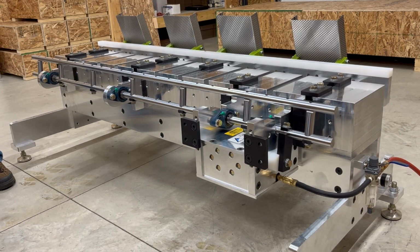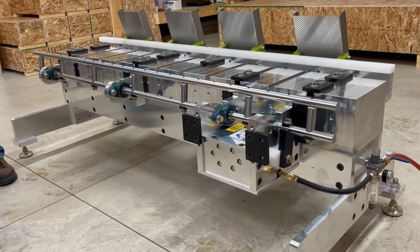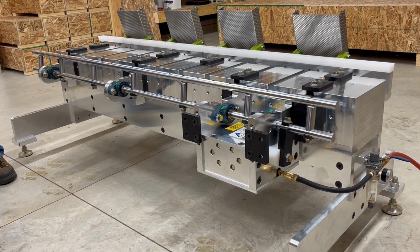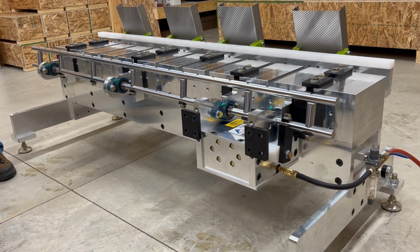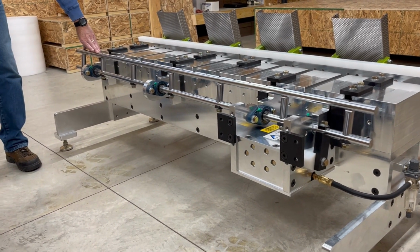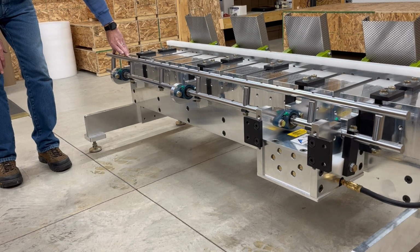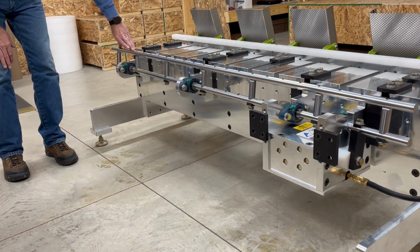We're going to wrap up this presentation with a live demonstration showing you a couple different things. First, we want to demonstrate the Radial Pro-LD's ability to resist off-center loading. To do so, we're going to turn the shaker on, set at 40 psi, which means it generates 175 pounds of push force. And then I'm going to oppose the pivot rack assembly down here on the end, 6 feet away from the shaker drive with my full body weight, which is also approximately 175 pounds, just to show you how well this resists that load.